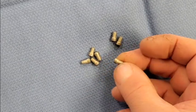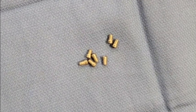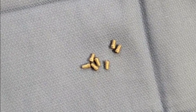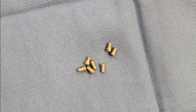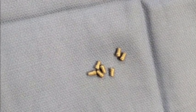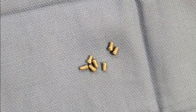They also come in 0.7mm or 0.8mm. The purpose of the flow restrictor is to slow down the flow rate going to the brew group. Because in a La Marzocco there is no infusion chamber, you're hitting your coffee with the full force of water — which means if there are any imperfections in the tamp, air pockets, or fissures, the water goes through there first and your shot is already ruined.